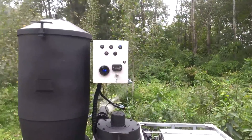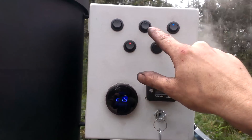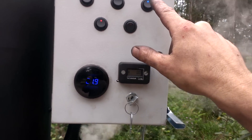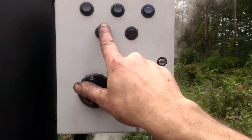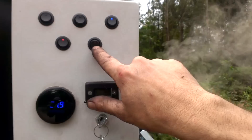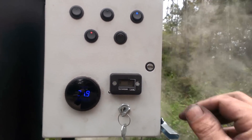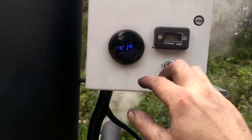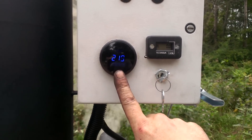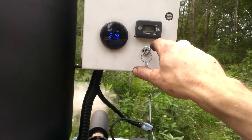This is the control panel, and this is for the automation system, blower assist, and the liquid cooled condenser. This is the blower, and this is for the fuel pump. This is an electronic fuel-injected engine, so I need a circuit to shut the fuel pump off to run wood gas. And then this here is an air-fuel ratio meter, and this is the RPM.